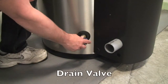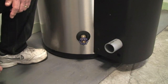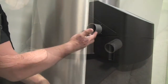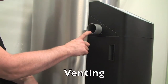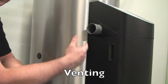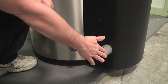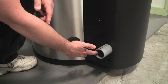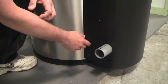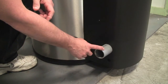The Phoenix also comes with a full port drain valve, so you can drain the entire contents of the tank. It comes already pre-plumbed and ready to go. The unit comes with PVC venting. You can see here that we have a two-inch connection — this is your intake. And as we pan down, you'll see your exhaust. Your exhaust always comes with a little bit of a pitch to it because we require a quarter inch per foot back slope to the unit to trap the condensate. Both the top and the bottom come in PVC.